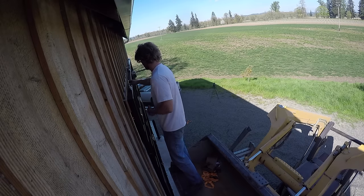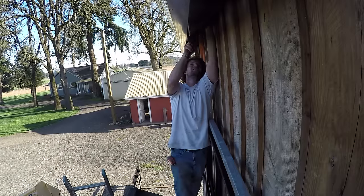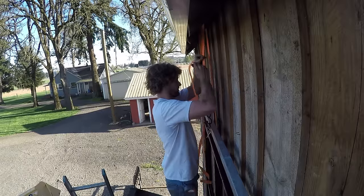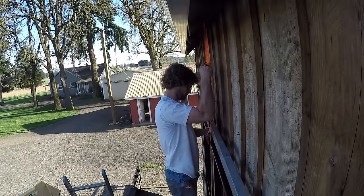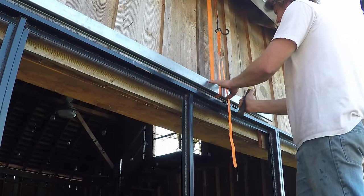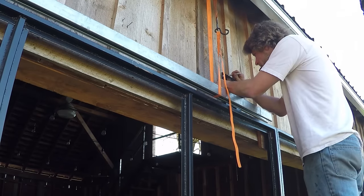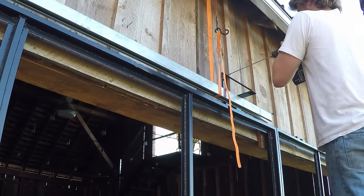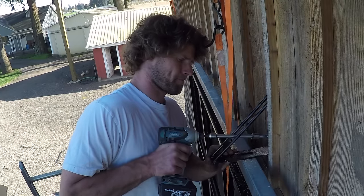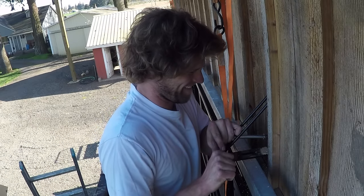I attached the rollers for the top of the door and slid on the rail. I hammered in a couple nails on both sides of the rafter directly above the rail, which helped me keep a strap in place while I lifted up on the door as much as it would go without actually lifting it off the ground. At that height I would mount the brackets. I marked the stud between the two nails, tapped the nails back in, marked the bracket bolt hole locations, drilled them out, and then drove in some four-inch lag screws. I would always hand-tighten them first so they don't strip out the hole — that little impact driver packs more punch than you would think.